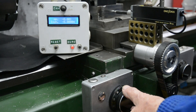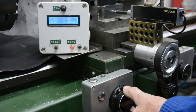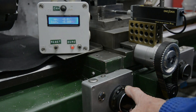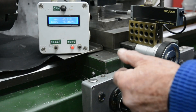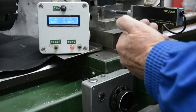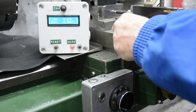Each click, if everything is working perfectly, will show an increase of 1 on the last digit of the display. Moving one click at a time — one, two, three — this is better than I thought. Every click is notching up 1 micron. What I found was that due to friction, sometimes one click wouldn't move anything, and then the next click would show a movement of 2 microns — the accumulated force from the motor overcoming the friction.